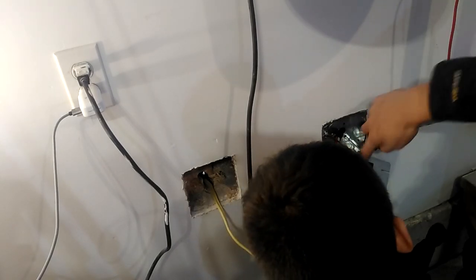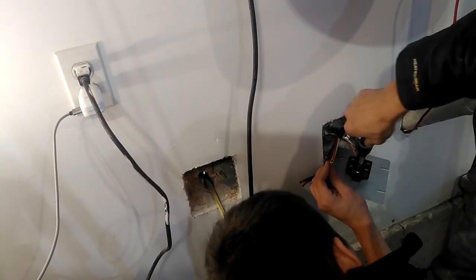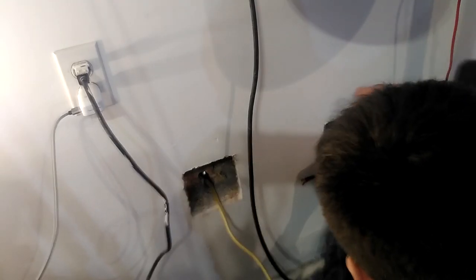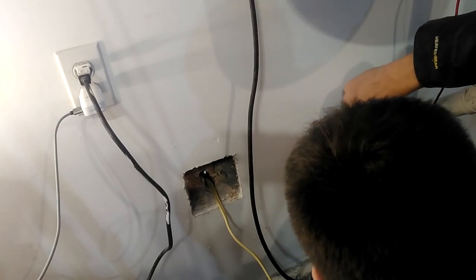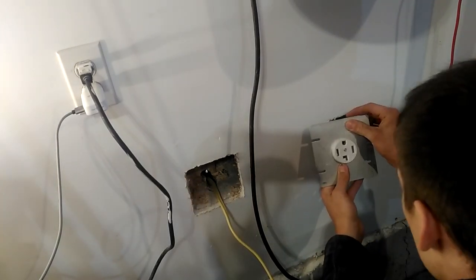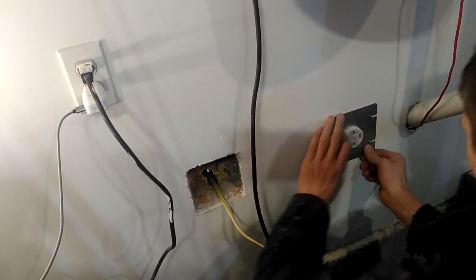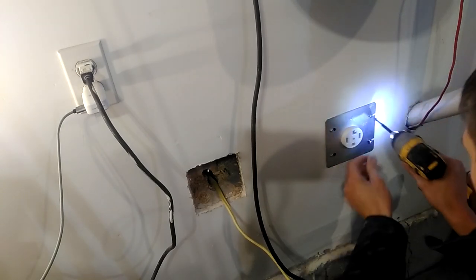It's a simple system. You unscrew the screws on the back with a flathead screwdriver, which opens up a little port. Strip back about half an inch of wire, make sure the ends are cut nicely, jam it in, and then tighten that screw down nice and snug on top of it — that makes a connection. They're labeled as to which one is ground, neutral, and hot. It doesn't matter which hot wire goes on which side — left and right are hot, and black or red, it doesn't matter. Once it's in, you snap it in and tighten those screws.